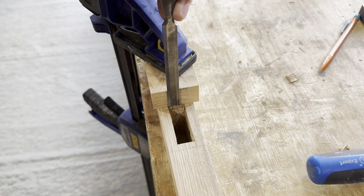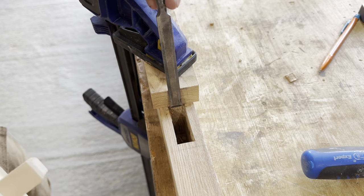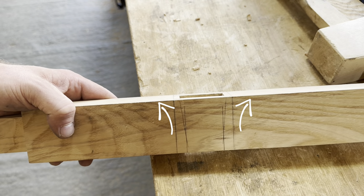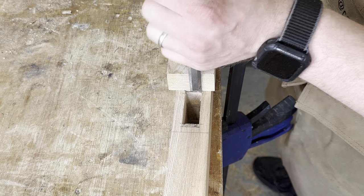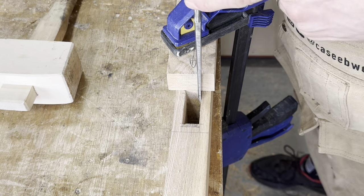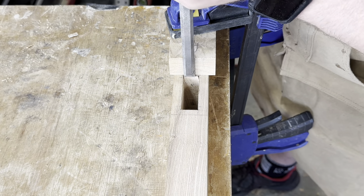What I'm working on here is some tapered mortises. This involves just taking a little bit off equally off each side to form a nice taper, so when I put the wedge tenons in there's a nice splay on the joint, as you can see with the lines marked out. To do this I cut a block at the angle that I wanted the taper to be at, then clamped it square to the mortise and used it as a guide to run the chisel down into the mortise and take the material off. I got this done on all four of the upright posts, which makes the joint lock in really secure and very decorative.